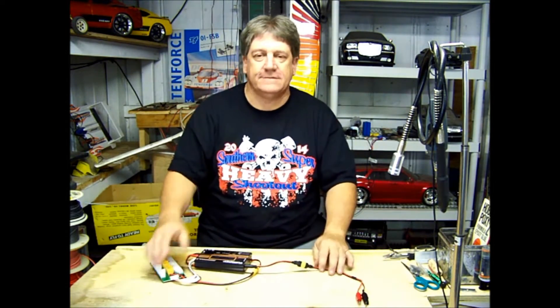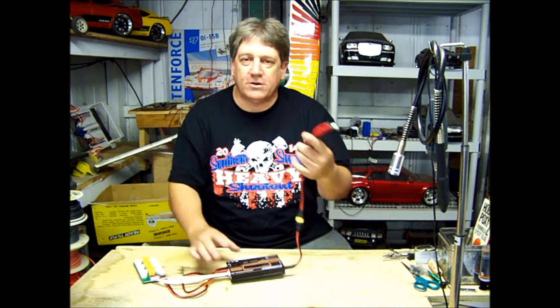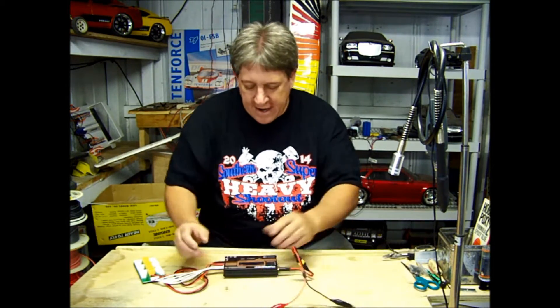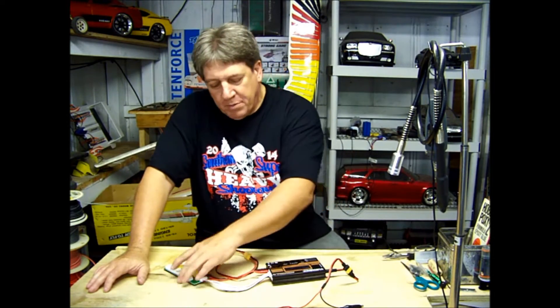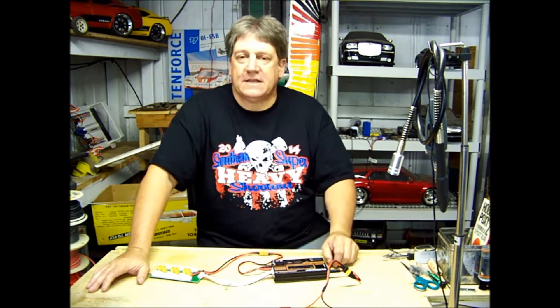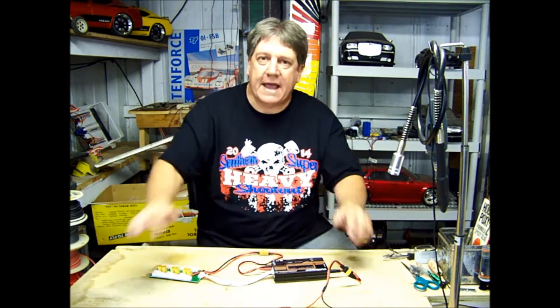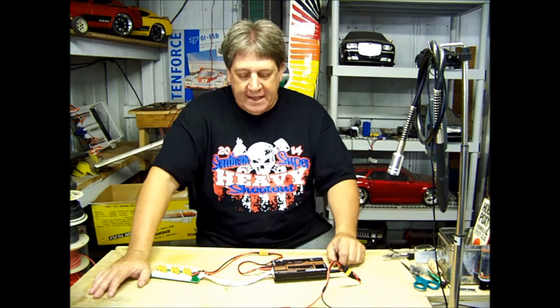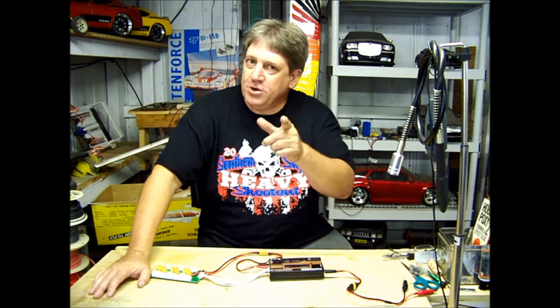How many of you guys are doing this? Come on, you guys are doing it. You're taking your alligator clips and clicking them onto the battery on your car, and this charger is sitting right on top of your car battery. Then you're going to plug your LiPo directly in there — and that's basically a bomb, because we all know you're supposed to charge LiPos in those fireproof bags — and it's sitting right on top of your car battery. If that battery goes up in smoke, chances are your car is going to go up in smoke.